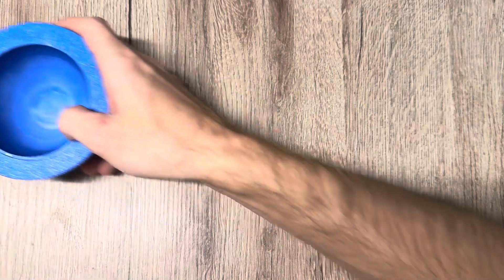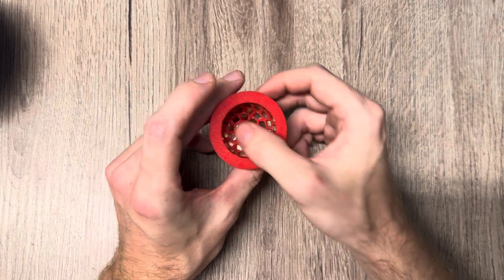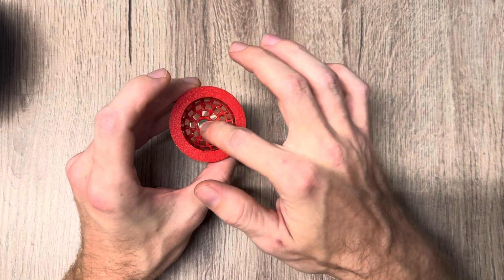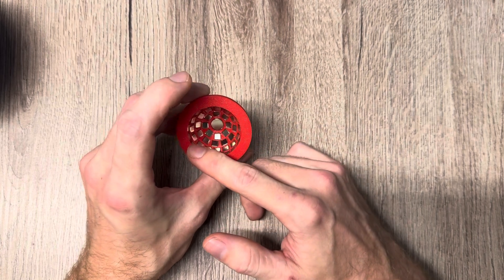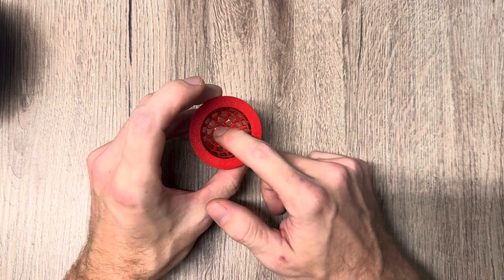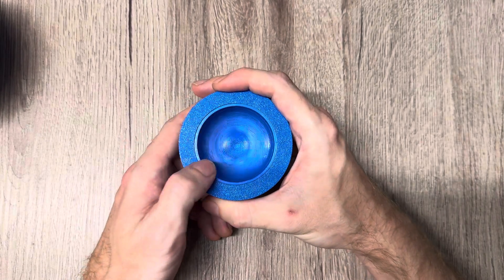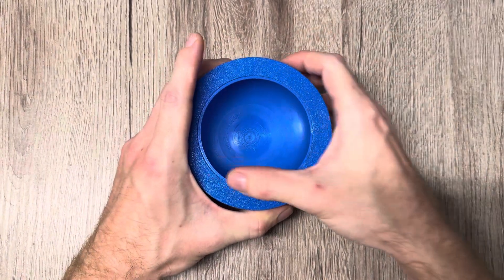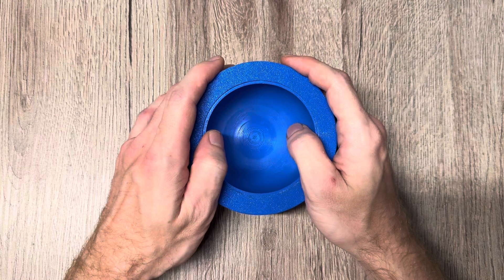First let me show you how these are made if you haven't seen that in my older videos. This small one is in red, but it is just the opposite polarity as the blue ones — the red ones are south poles facing inwards. With the small one we have 54 pieces of 5mm neodymium cube magnets of the highest strength N52 grade and a 10mm disc magnet at the center. The medium sized one has 59 pieces of 8mm cube magnets and a 20mm disc magnet at the center. The large one has 89 pieces of 10mm cube magnets and a 25mm disc magnet at the center. These arrays are already quite powerful.